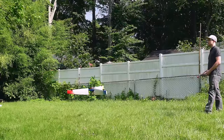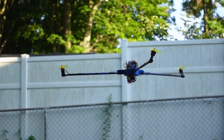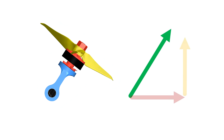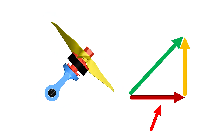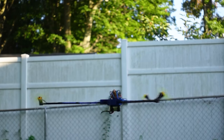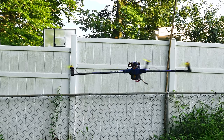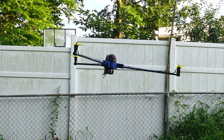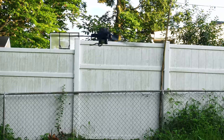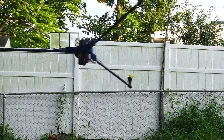This seems very counterintuitive. If we tilt the motors to enable this spinning, a substantial fraction of their upwards thrust force is lost. If they tilt to 45 degrees, that's half of the total thrust now pushing sideways and not up. This means that the drone will fall if throttle isn't increased. Using our intuition of a regular drone without additional airfoils fitted to it, this would mean that to hover with the motors at this angle, they would basically need to double their power to match the vertical thrust component with the downward weight of the vehicle, enabling a steady-state hover.